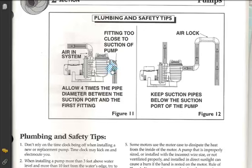This is Harvey's big pet peeve — hydraulics are huge, especially going into a pump. Remember: four times the pipe diameter, so if this is two inches, you have eight inches of straight pipe before you go into that pump. That's minimum. So if you had a Jandy valve, a Hayward valve, or any kind of valve, you come out of that valve, eight inches, and what I would do is put a union right here. Then I come out of the union and put in my Jandy valve, or whatever you want to use to turn off your skimmer or main drain. And I would put a union here too, because you have a need to disconnect the pump — a union makes things so much nicer.